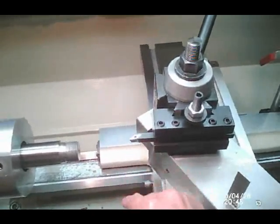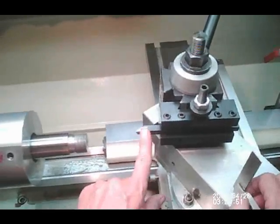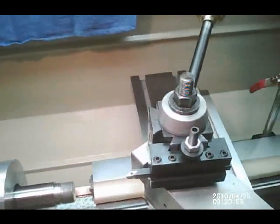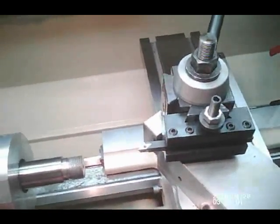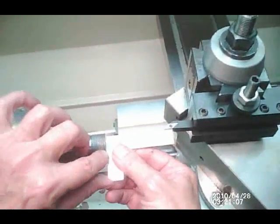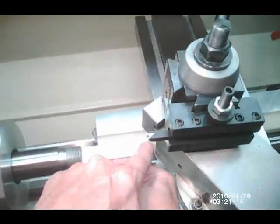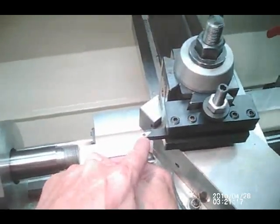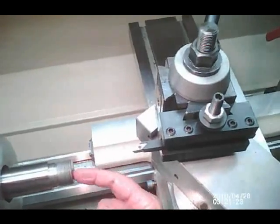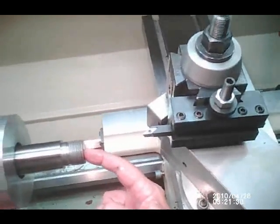You can get the Arthur R. Warner tool from their company in Latrobe, PA. It's got a nice reach on it and is fully supported underneath so you don't have to worry about flexing. To line this tool up with your bore so you get a nice straight wall cut, take a small square, set it up along the face of the barrel, and line your tool up perfectly. This allows us to cut from inside out until we have a hole 708 thousandths wide and 144 thousandths deep.